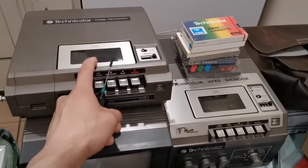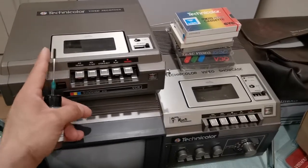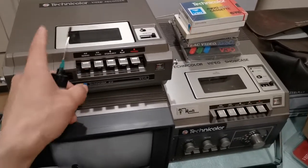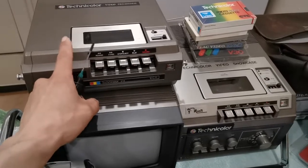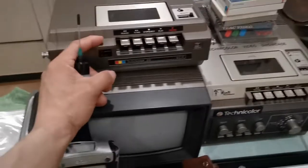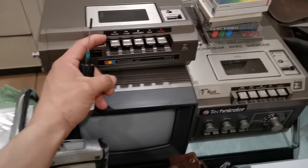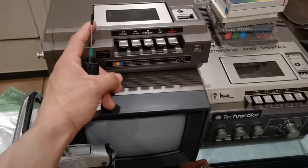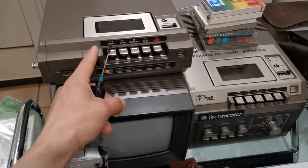Incredibly noisy machines. This machine I was able to repair. I plan on making another video where I can show you. It's very easy to fix these machines. About 80% of the problems are actually just hot glue. I'm not sure you're familiar with hot glue. After about 20 years, hot glue becomes conductive. The way I repair these two machines is simply by removing hot glue.